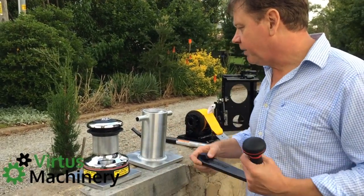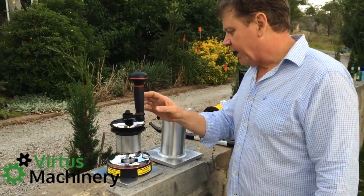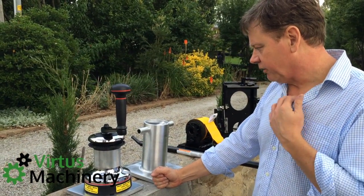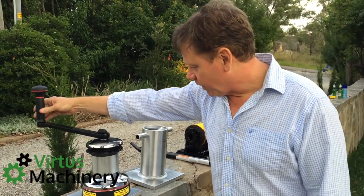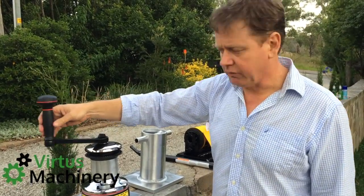It's a two-speed winch, actually adapted from a boat winch made by Harken in the USA — a quality piece of equipment. Stainless steel, brass bearings and cogs inside. When you don't quite need all the extra leverage, you can turn it one way, and when it's asked of you, take it the other way. So it's a true two-speed winch.